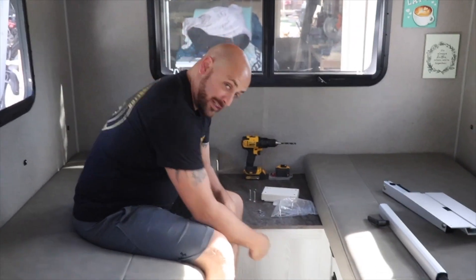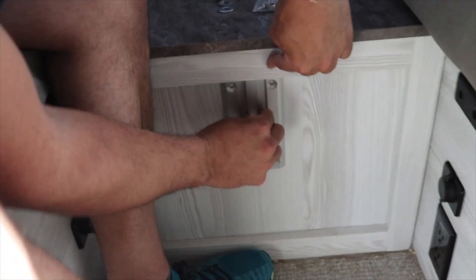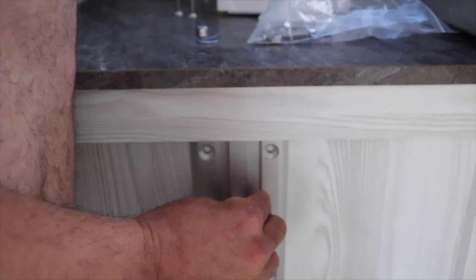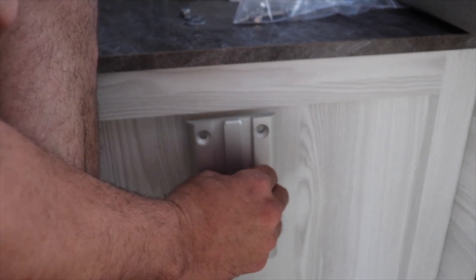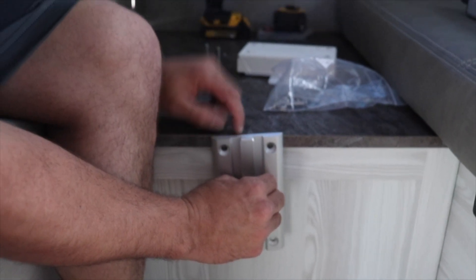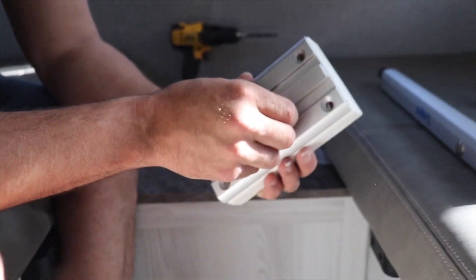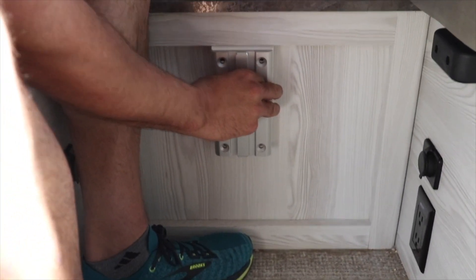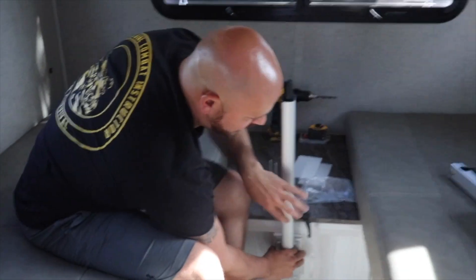Something to take into consideration here — when this gets mounted, it mounts flat. But the top piece of the cabinet is covering this T-slot, and that's where this needs to slide onto. So for this to be effective we need to get it out in front of this tabletop section. I had to create a little block, the exact same size as the mounting plate, so now when this gets mounted our T-bar will have no problem attaching and being able to slide up and down.